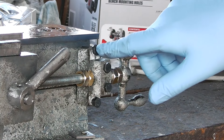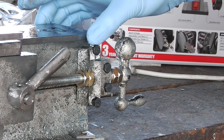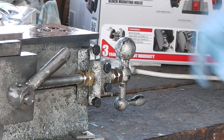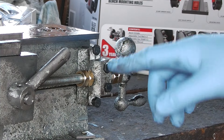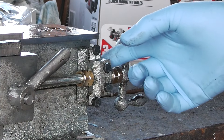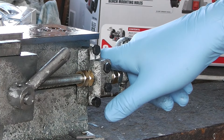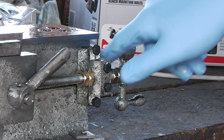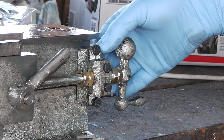I'm getting rid of this bolt here because I can't slide things straight off the end — this is too jolly high. So the plan is I'm going to take this off and drill through all the way through to the bed itself, so the bolt will go straight through to the bed and I can cut this end off entirely.